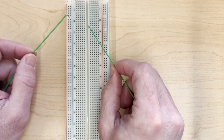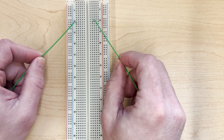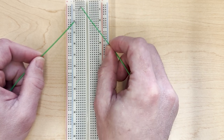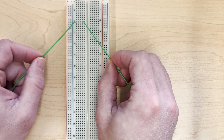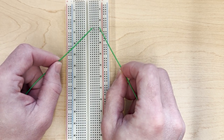They are separated at the middle line. So even though they are in rows, if you put one here and one on the other side of the center line, these would not be connected — they're only connected on the specific side of the center line. On one side, these would be connected, and if you move to the other side, those would be connected.